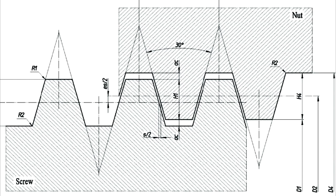Both V-shaped and trapezoidal threads are made the same way, just with a different shape cutting tool - accuracy has nothing to do with the thread form. Lead screws are usually made to a closer tolerance whereas threaded rod is often not specified, but both are made on the same machine. At a push you could use threaded rod; it just means it's more likely to bind, especially if you get debris on the thread. It's not the cardinal sin some people make it out to be.